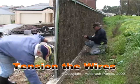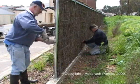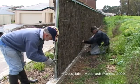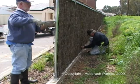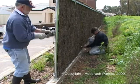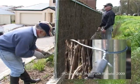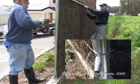It's easy to break a wire when tensioning, twisting. The correct way to do this is to make sure that both wires are twisting around each other at the same time and not one wire twisting around the other one. And the way to do this is to keep your plier nose at right angles to the pair of wires you're twisting. So you pull and twist, pull and twist.